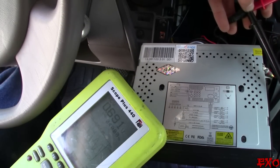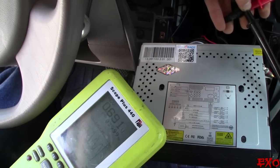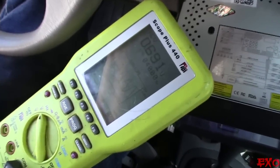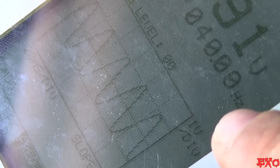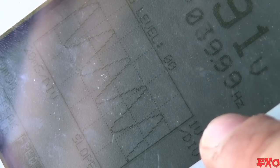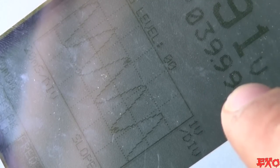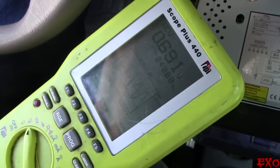We're at 0.69 volts. But see how it just said 42 hertz randomly? This is a 40 hertz sine wave — it's reading 39.9, 40, then suddenly 42, back to 40, 39.9, 42. Every time this random spike comes across the screen it changes the frequency and changes the wavelength. There it is — bam, right there. You can see it going across. So there's some sort of distortion happening: this is a perfect 40 hertz sine wave but we're getting peaks of 42 hertz — possibly even 44 hertz. Something seriously wrong is happening there.